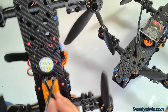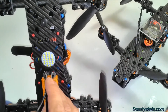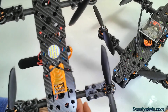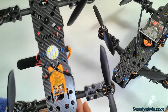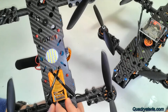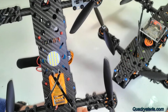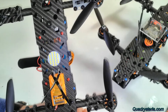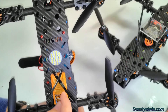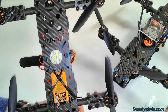A big reason I like this R800 receiver is because it has dual long antennas. I've done a quick check and the orange receiver has a small version — it's a three-channel PWM but it has SBUS, which supports up to 14 channels, and it has dual long antennas. I think that is the ultimate setup. It's really tiny as a three-channel PWM, so the form factor will be really small — dual antennas, DSMX, which is the latest.